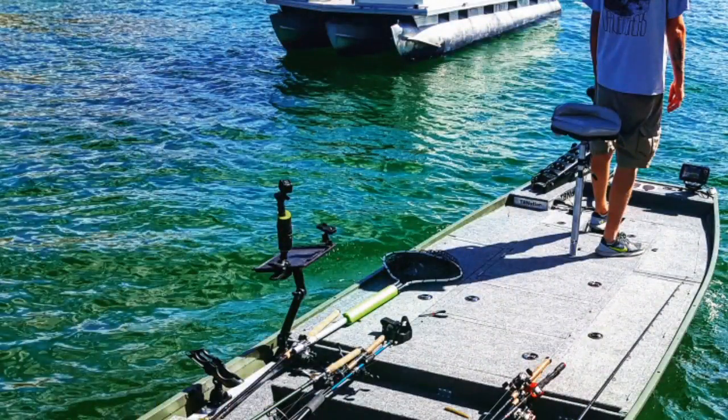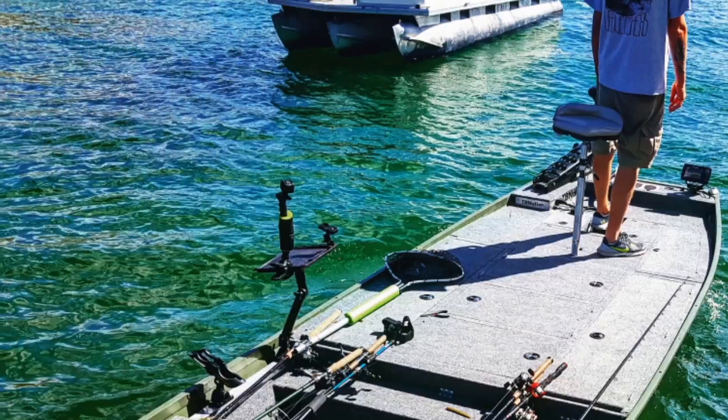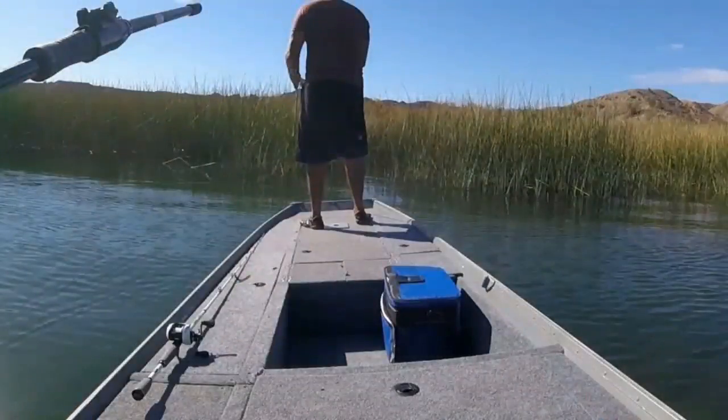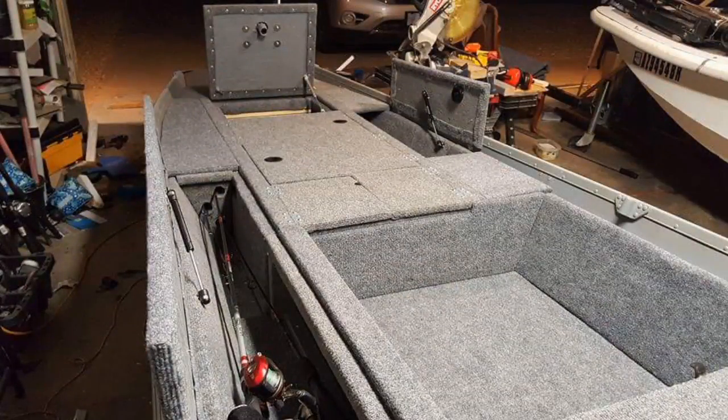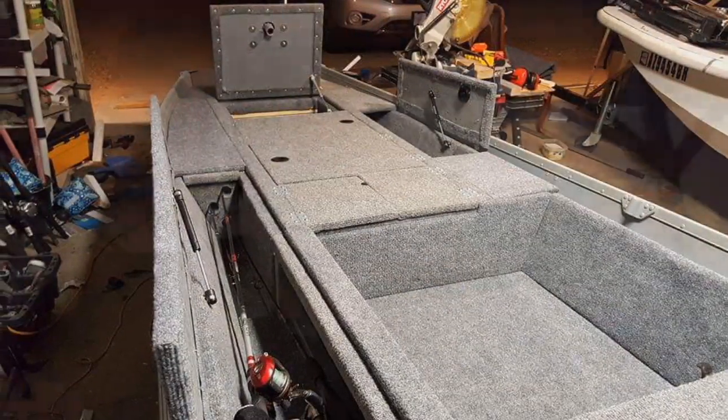Length not so much, but width — 42 inches or wider is a pretty stable boat. 42 inches minimum for doing two people on the watercraft. If you're specifically trying to make a one-man monster for backwaters, waters with horsepower limits, length restrictions, or electric-only lakes, a 12x32 or 12x36 boat will be great. Trying to run two people on a boat like that would be miserable — one of you would eventually fall off or you'd just be frustrated with the pitching and rolling.